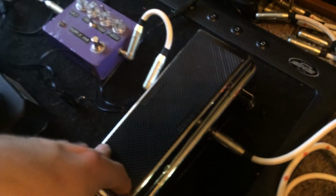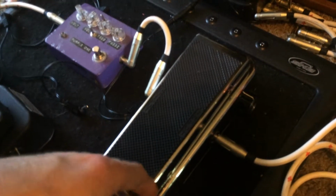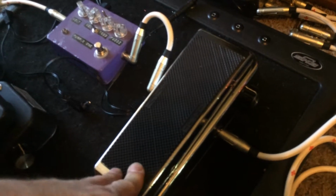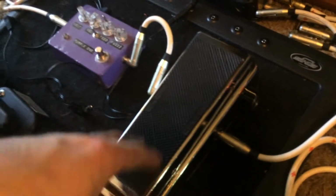and then like your Cantrell, Dimebag, Slash, Zakk Wylde style caps on there, so you can screw with that. On the inside, it's got a Fox Rock style circuit for the output buffer rather than just a basic FET output stage like the 535. I went with that Fox Rock circuit where you can adjust the gain, so you can set the output boost, and it's a little bit better sounding op amp than the run-of-the-mill quad op amp they use on a 535.